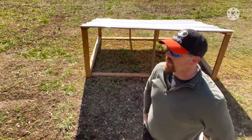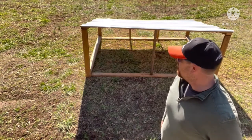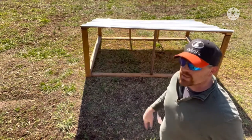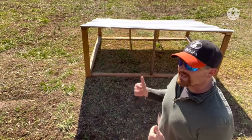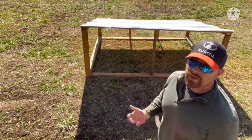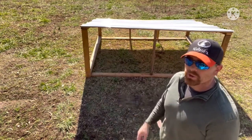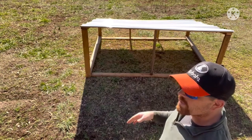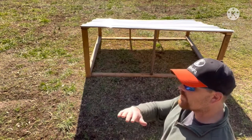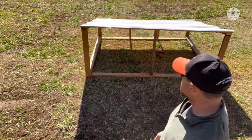While I was building it, I realized I would have liked to overlap the panels a little more. I probably should have bought the panels sooner in the process and figured them in better. I did have some overlap, which was great, but not as much as I'd have liked. I don't think it's going to be a big problem since most of this is for sun rather than rain. We'll see how it holds up in the rain, and if needed we can put some flex tape over the joints. I also should have started overlapping at the bottom and worked my way up — in the direction I did it, rain can run into those seams more easily.